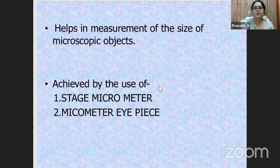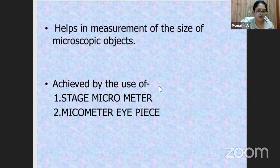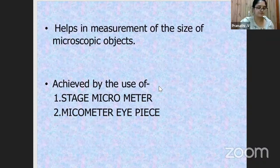So this means that it is a 170 millimeter tube. Cover glass thickness is 0.17 millimeters, and it is a plano lens, PI or PL, a plano lens with a flat field, and it is an apochromat oil immersion lens which has been corrected for 3 different colors, that magnifies 100 times, 100 by 1.32, and the numerical aperture is 1.32 over here when it is under oil immersion. So for oil immersion, usually it is cedar wood oil that you use, and other markings are also there.